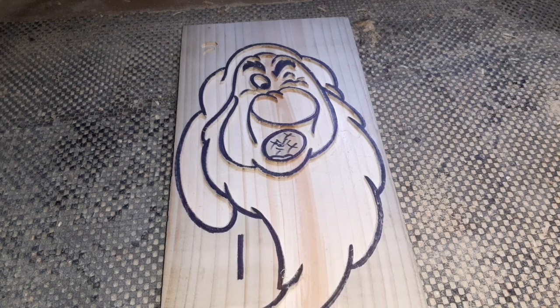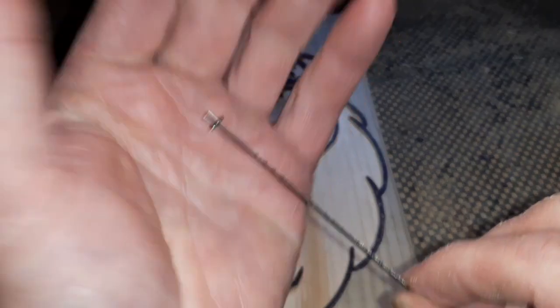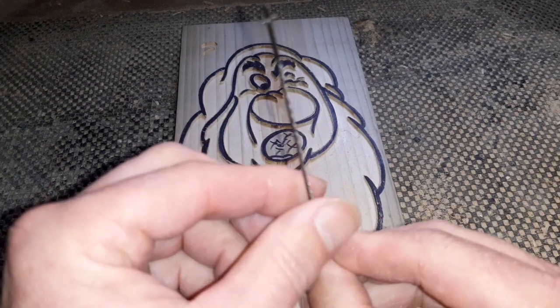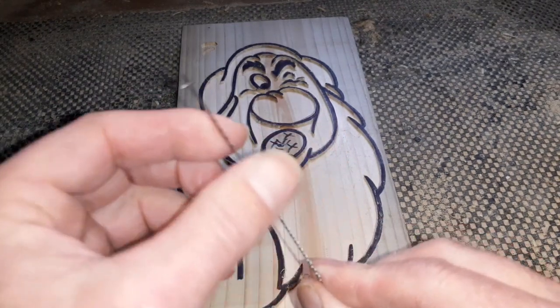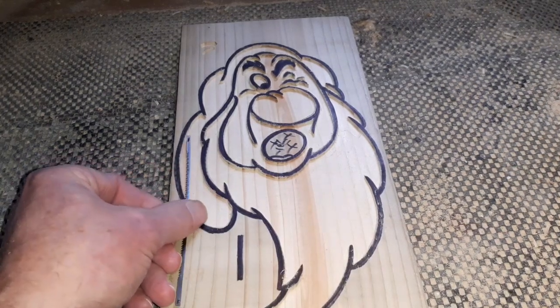They come with three different types of blades. I'll just show you quickly. There's a standard pin blade. They'll have a pin at both ends. That would do on this saw, no problem whatsoever. When you put your blades in the saw, you want to feel smooth on the way down and rough on the way up, and have the blade facing towards you. This will do this project, no problem.